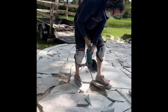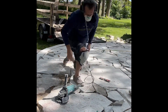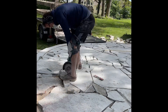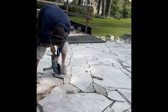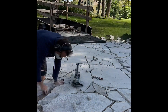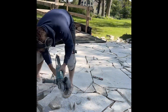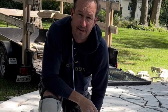I wear the mask, headphones, and knee pads, and I had to cut each piece. This was really painstaking — after you get the big pieces in, all the gaps need to be fitted with smaller stones. You look for stones that kind of fit, but none of them really fit exactly, so you get one that fits close, cut off the corners or edges that don't, and then level out the limestone underneath it.